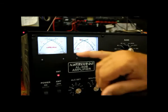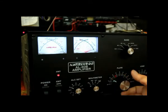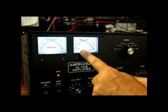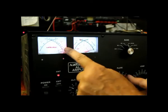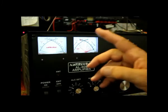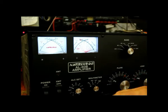I turn the amplifier on to operate and I see I've got a little over 100 milliamps of peak grid current and 75 milliamps of average anode current. And I start to peak the plate first. The output power here is going up as I peak the plate — it's up to 200 watts now, 300 watts — and the grid current is starting to climb. It should go up rapidly when the output power stops going up rapidly. You see this red light right here tells me I'm getting to the grid current limits on peak grid current. And there it shut off — it shut off because of the automatic overload feature. Let's reset it once. See it goes right back off again because I have too much grid current.